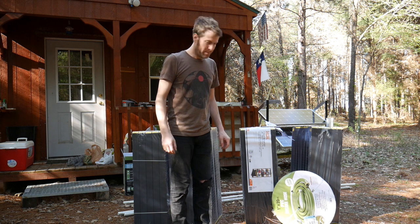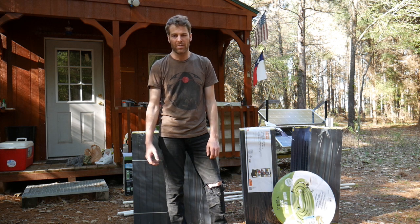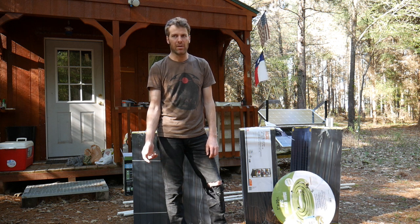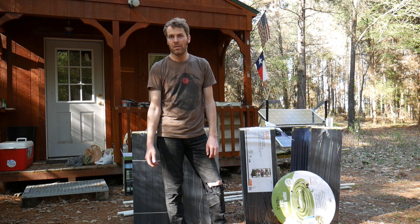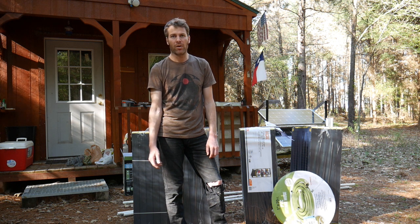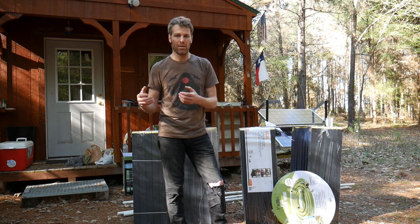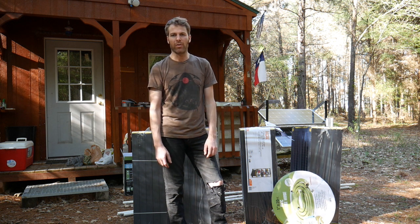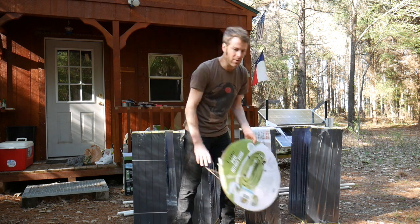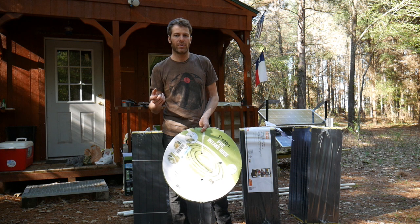Next thing I'm going to try is bring that whole pump up the hill a little bit, because it's rated for 25 feet. People online say it goes 40 to 50 feet, and right now it's only 15 to 17. So my thinking is its primary purpose being a pull pump as opposed to pushing. If I can get it uphill and push the motor more that way, then hopefully it can just free flow out here. So picked up another 1 inch by 20 foot intake to attach to the one that's already going down the hole.